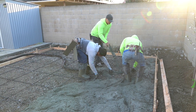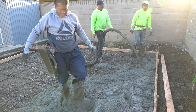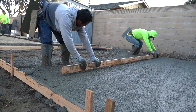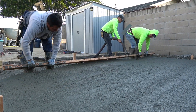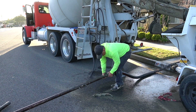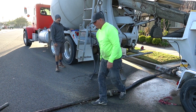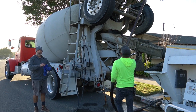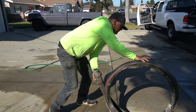We're pumping this down — 3,000 straight cement, no fly ash, with microfibers, probably a five and a half or six slump. I'm going to be watching my pump out here. We laid it down in about 20 minutes. That's about 150 to 175 feet of hose, put down in 20 minutes — not going wide open, just laying it down steadily.